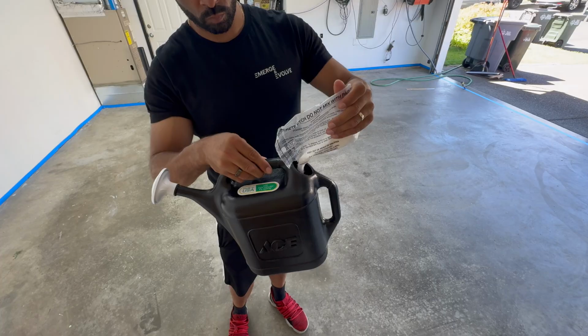I'm opting to use the anti-skid additive. I was going to not, but a friend of mine hit me up and said that they highly recommend doing it. So I'm gonna go to the store and buy some of that anti-skid additive to add to the mix. It should add a little bit of protection as far as not slipping and sliding around on a wet coating. So for now, I'm gonna get the acid etchment stuff. They recommend doing 10 by 10 sections, and we'll just get that knocked out.